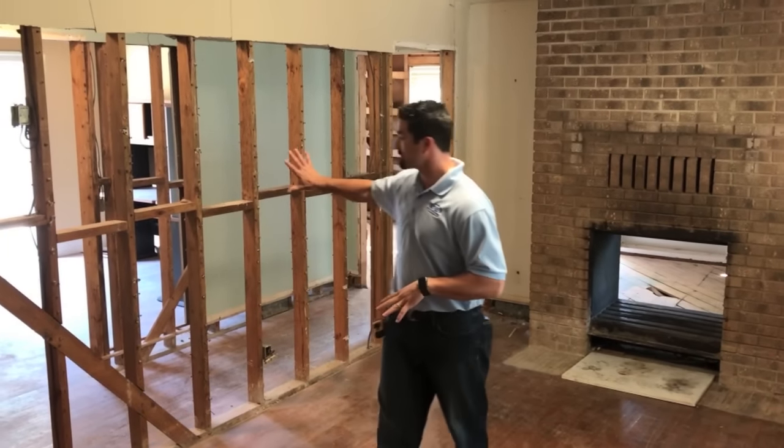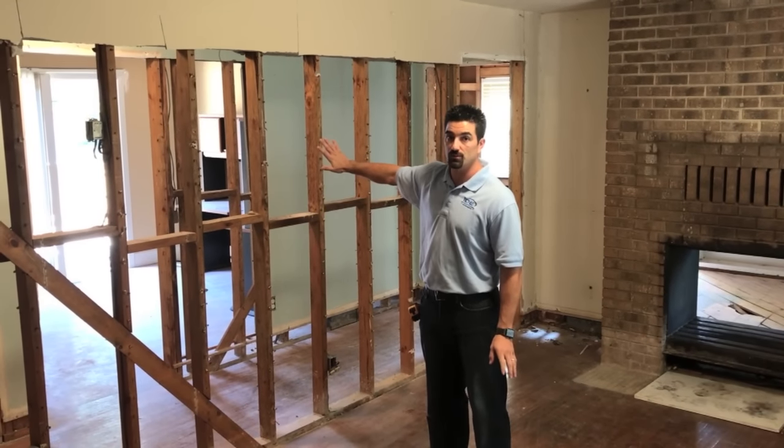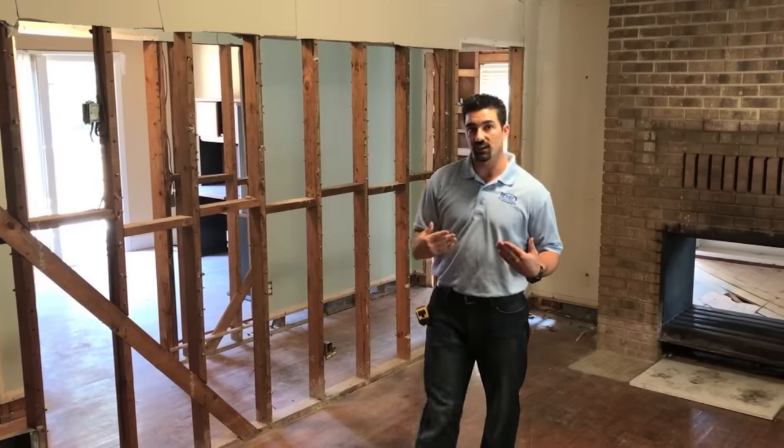So we're back down in the living room. We've determined that this wall is load-bearing, the other side of the hallway is also load-bearing, and the closet wall is non-load-bearing. In this particular case, we have an attic above, which makes it a lot easier to figure that out. That's not always the case.